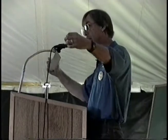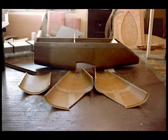The only thing unique about my airplane is that I used the same hot wire techniques that are used primarily on wings in Rutan design airplanes. That is, we stretch a hot wire between two metal templates on each end of a block of foam and carve out that airfoil shape. Works very well for wings, but nobody's used it on fuselages until we tried it on this airplane.